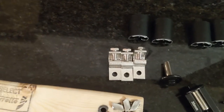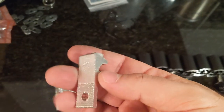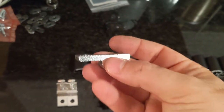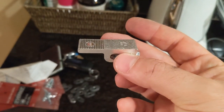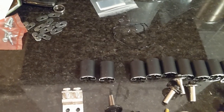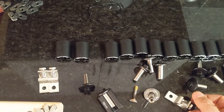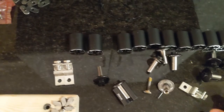So these are also made by the same company, and this is grounding hardware. On each solar panel I'm going to use some self-tappers, and I'm going to self-tap it up on the ledge of the solar panel, and then I'm going to connect copper wire. I'm going to string them together, and then I'm going to run it down into the van and into the bus bar or the grounding bar.